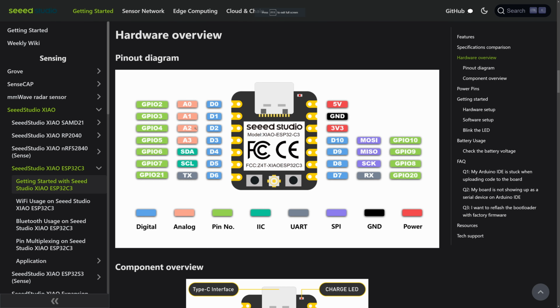When I'm doing that, I am making sure that I use one of these analog input pins. Again, there's a limited number of pins because this is such a small board. So anytime you do analog input, make sure that you're on an analog input pin. I ended up using A2 here because I knew I could get an analog input. Now this also had to be sorted out with my buttons